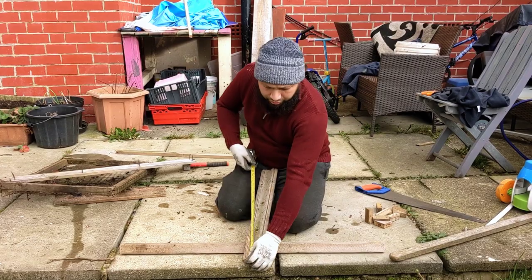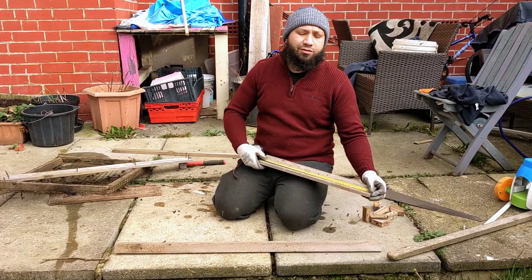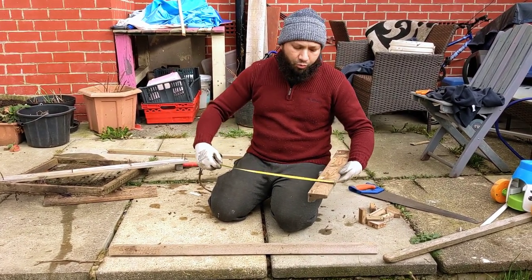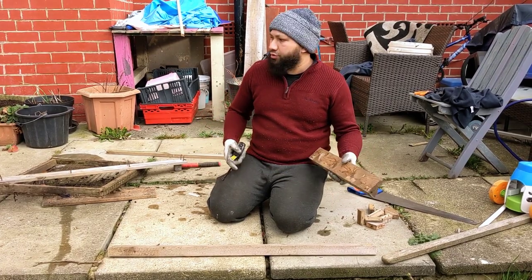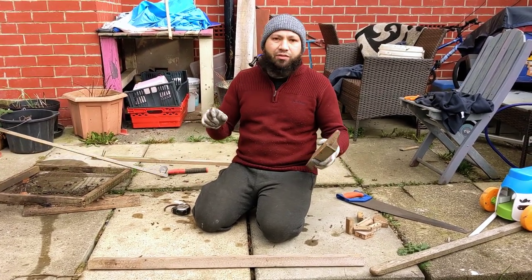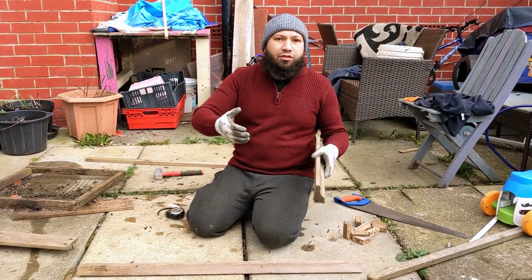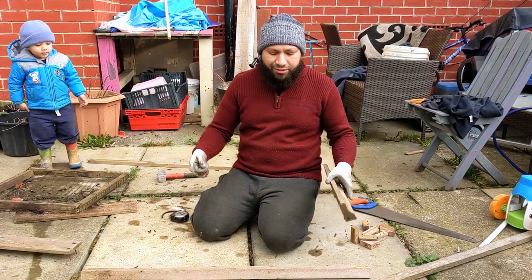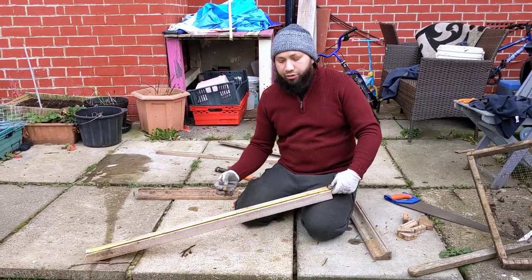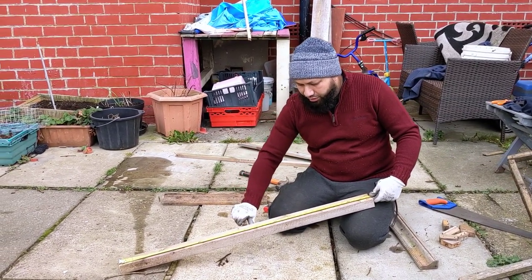The side length I'm going to use is about 50 centimeters — that's a good size to get a good shake in. The width is about three inches. What I've noticed with the old one-by-one is it's quite thin, and when you're sifting, everything falls over the top. This will hold things in a bit better. This piece of wood is a meter length, so I'm going to cut it exactly in half — I'll just score it so I know where my line is.